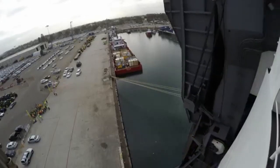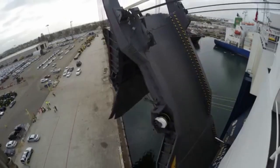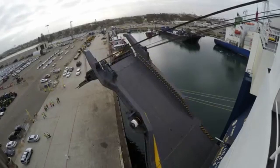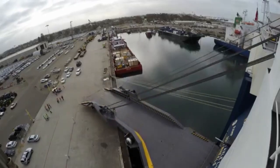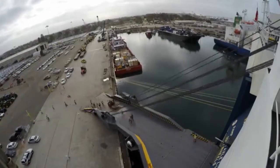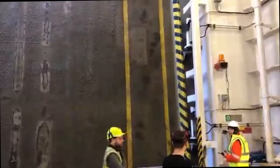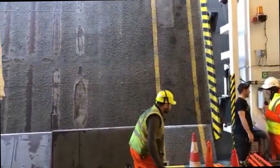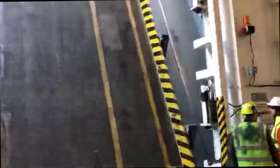In this video you can observe the stern ramp is in two parts, hinged in between and folded inwards with the help of winch wires. The hydraulic jacks on the ramp push it while wire ropes help in unfolding it into one straight piece, which is then laid on the jetty. When any external ramp is in its closed position you can observe the hydraulically powered cleats — hydraulic locks — which lock the ramp to provide watertight integrity, along with pockets for the cleats to attach.